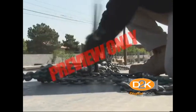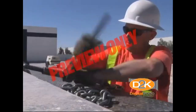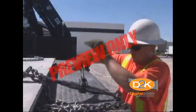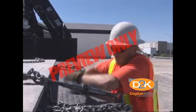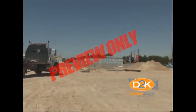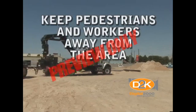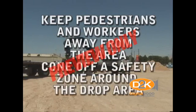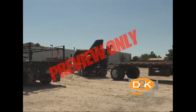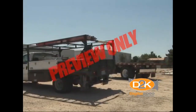When securing loads, be very careful to bind the load with adequate chains and binders. Chains and binders have a nasty reputation of fracturing or even amputating fingers — use extra care when binding loads and keep hands and fingers away from pinch points. When arriving on site, check for a safe location to leave the load. You must be careful to keep pedestrians and workers away from the area, so double check and cone off a safety zone around the drop area. The driver or operator in charge must have a clear understanding of the work to be performed and consider all potential dangers at the job site.